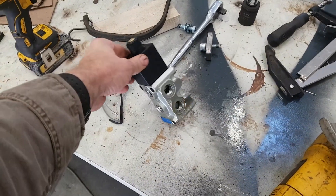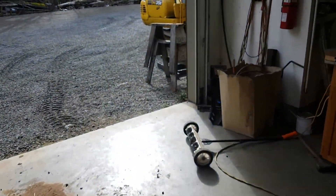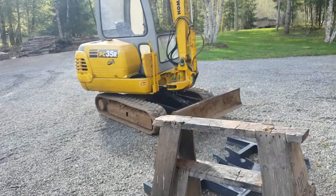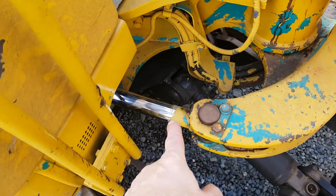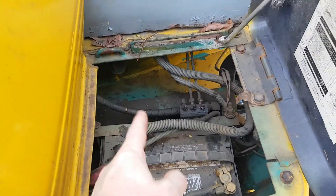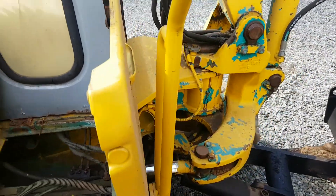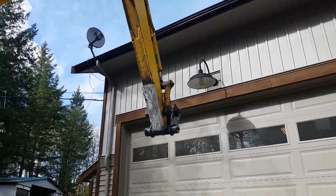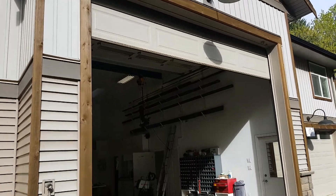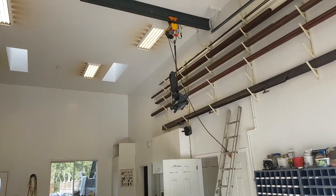This is the diverter valve - it's going to go on the offset swing cylinder circuit. It's got a pedal on the floor which actuates it. I'm going to tap into the hydraulics for that and use the solenoid diverter, and that will make the pedal run either the thumb or the twist wrist - way up there - depending on what's attached.